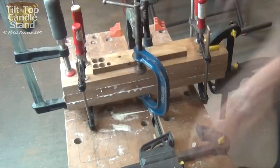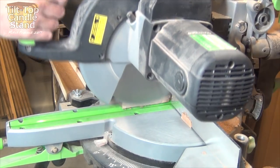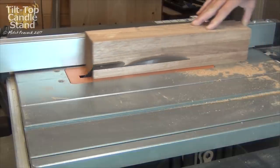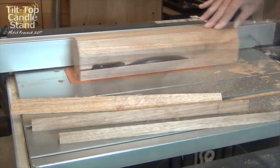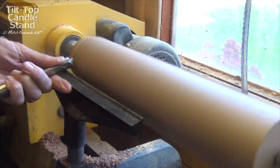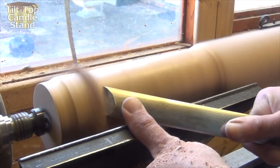The more difficult approach is where you leave the column circular and you cope the shape of the shoulders on the dovetails — obviously that's a lot more difficult. I'm using light red meranti for the structure, and that does have a few little problems: it is quite difficult to finish nicely and it doesn't turn very well, so my turning as you shall see here is very basic. I'm not going for the classic Shaker style column; I'm just doing something very simple.